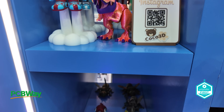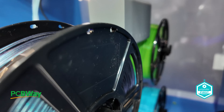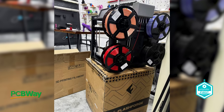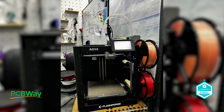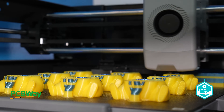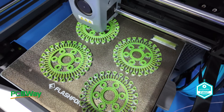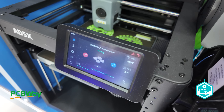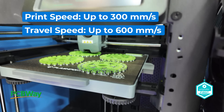Flashforge is also promoting TPU printing in multicolour, which given the machine structure and feeding mechanism shouldn't pose significant issues thanks to their IFS — Intelligent Filament System — though it doesn't seem applicable or backdatable to older machines, which is a real shame. Hotends capable of reaching 300 degrees, which this one can, seem to be becoming the norm, pushing the boundaries of material science on reasonably priced printers like this. We're still missing that enclosure, but maybe that will be in the next iteration.